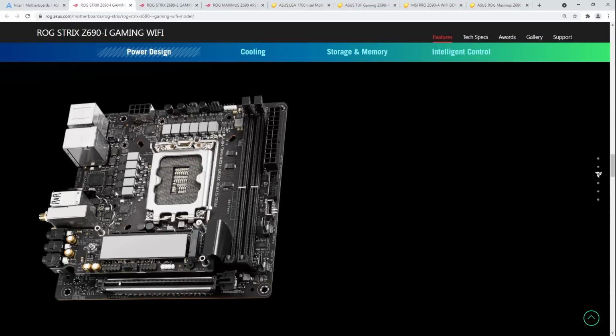Oh, damn, they actually have a really nice picture of this board. I wonder how good the transient response of this VRM is, because this is all tiny little tantalum polymer capacitors. I've considered using these little tantalum polymers for cap modding in the past because the ESL of them is ridiculously low. They are well into the territory of multi-layer ceramics, compared to the regular SP-cap type capacitors that they have for the memory power.